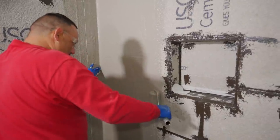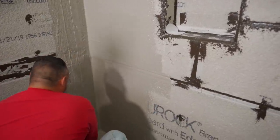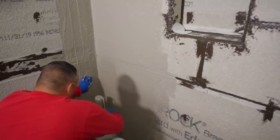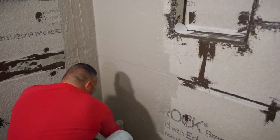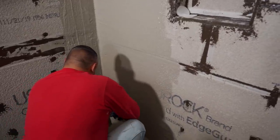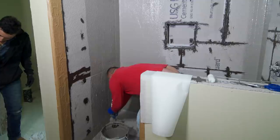You see those really dark, shiny spots? It's a thick, heavy material — when you're working it, just make sure you're working all that excess liquid everywhere. A completed area will look like that corner over there — see how it's shiny? There are no dull spots, and most importantly, no white spots bleeding through it. Full saturation. See the caulking joint that goes across there? His fleece has that same shape — that means he's got it stuck up against there, which tells you he's got better adhesion. If you start seeing round spots and bubbles, you've got to get the air burped out of it. Don't forget to double-check the ground where you're working — make sure there's no heavy puddling from everything dripping down.